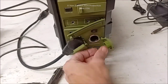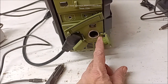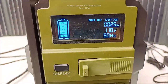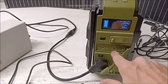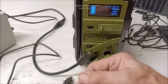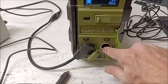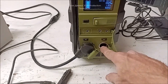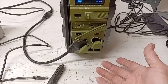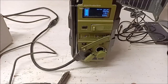With that little freezer, the freezer starts at 13 and a half amps and this says it's 10 amps, but it didn't shut off. You can hit the DC button and see them all light up — two outputs right here, good for 10 amps together. You can run one at 5 amps, the other at 5 amps. The startup on that compressor is about 13 amps for 3 or 4 seconds, and it didn't care.